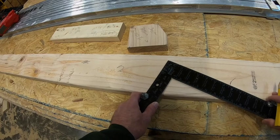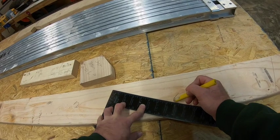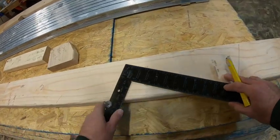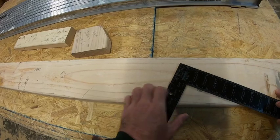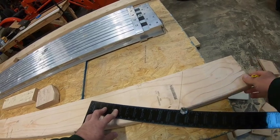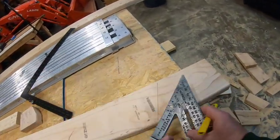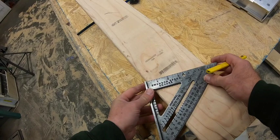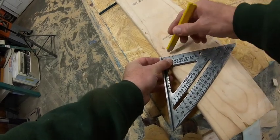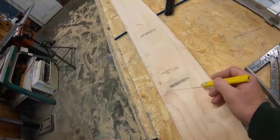From that 60-inch mark, I come over to my 7 and 5/8 inches — get lined up on that mark — and then mark my 12-inch overhang. I only bought 8-foot boards so I can't physically carry this off the board to get that last mark, so what I do is take my speed square from that mark and get my 5 and 12 pitch and mark that. So this includes my overhang.